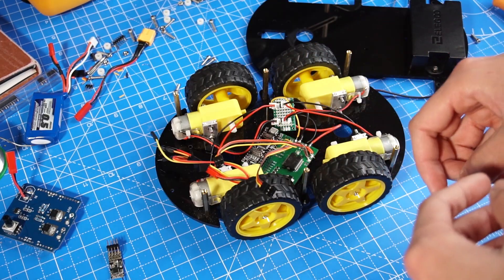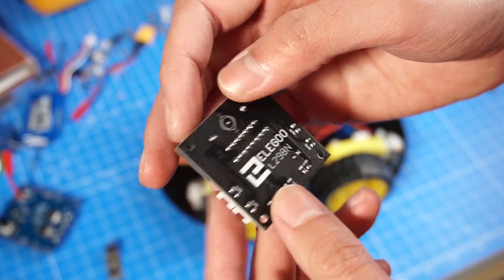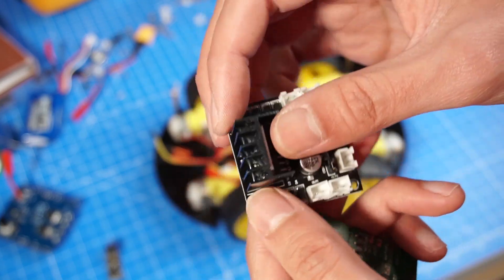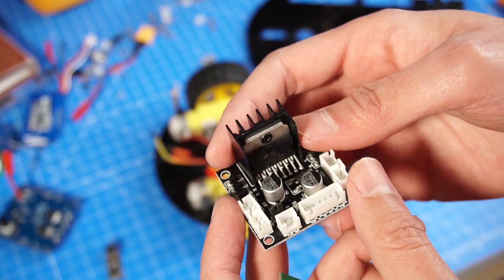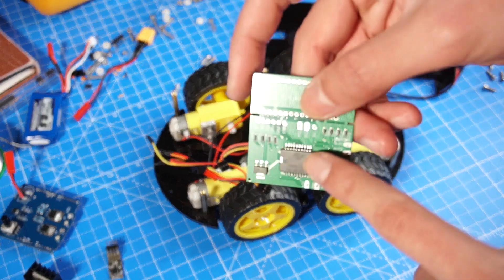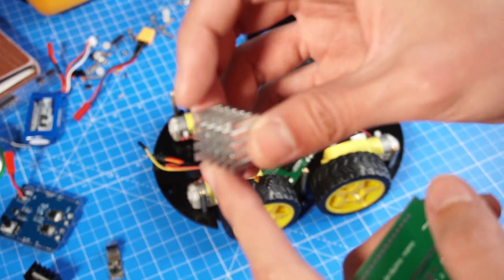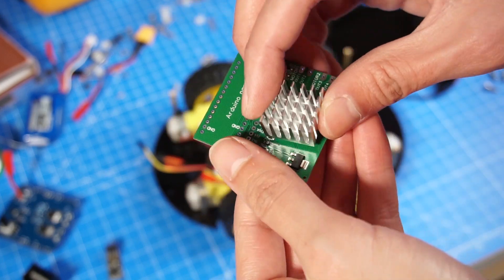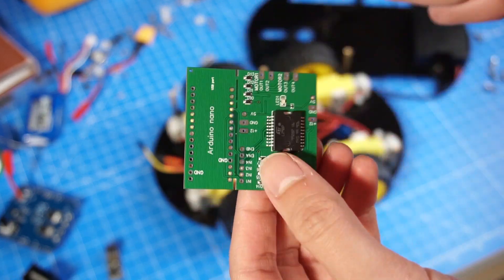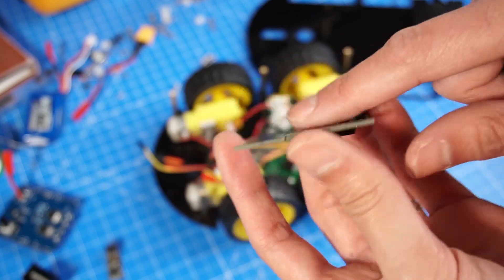One concern some people will have is that heat might be a problem with this kind of chip. With the popular L298N module it comes with a large heatsink. The only time I had a problem with heat from that module was when using stepper motors. I've tested this design and it gets a little warm because these motors don't draw a lot of power. But if you want to keep it cool, add a heatsink on top with some thermal paste and some glue — that should be more than enough. The rest of the heat will dissipate through the plate underneath and throughout the whole board.